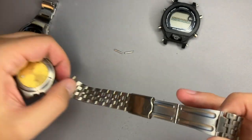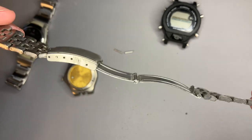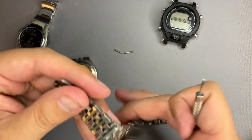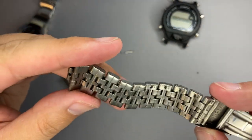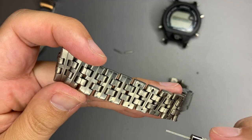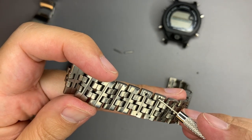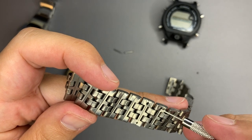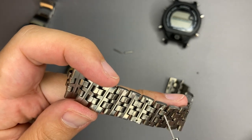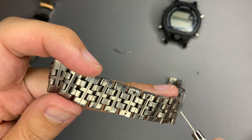Now that the bracelet is released, we see that the bracelet is made of stainless steel. This bracelet uses folded links and we can also see that it is very worn out - it is visible. Also, the way that you adjust the watch is very simple: you just take out the inner part of one link by putting this needle in this hole and push it in the direction indicated by the arrow. This is how you remove one link and then you match them together.